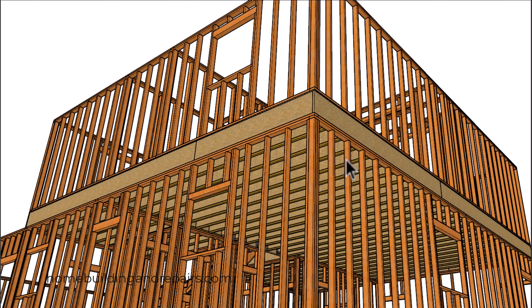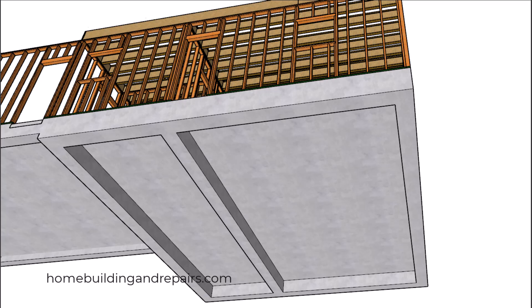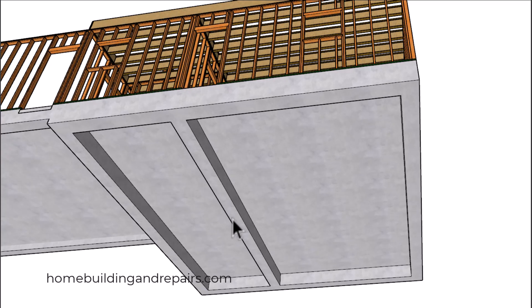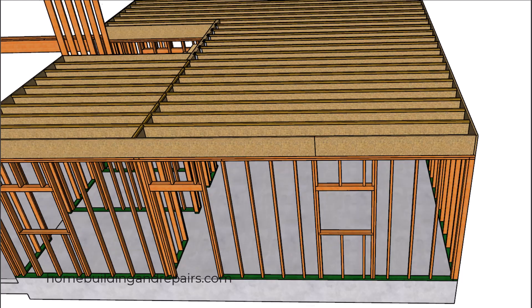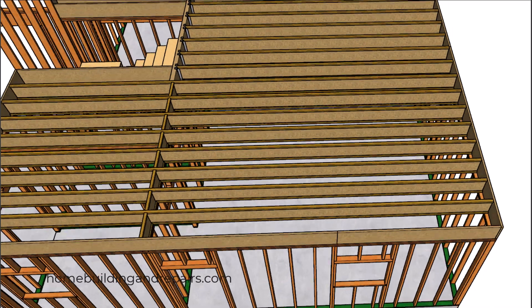You can see here where the joists are running this way — they run continuously through the house. Since we will be adding a structural beam, we're probably going to need larger footings in this area where the posts are going to be transferring the weight to the foundation. You can see where something like this could be a nightmare if it was going to be a remodeling project. The joists are going from one side of the building to the other.